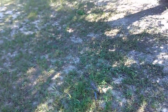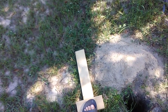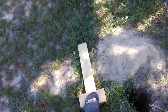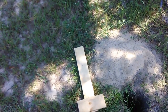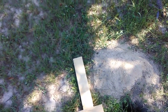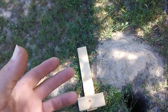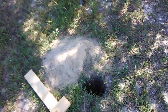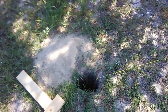When you get your lumber to do something like this, always pull out the heaviest, beefiest lumber you can. You've probably noticed when you go into a lumber store and get some treated wood, some of those boards can be light as a feather and others can be heavy as hell. The heavier the board, the denser the wood is and the longer it's going to last. Always get the heaviest boards you can for something like this. I expect something like this will probably last 10 to 15 years — and as old as I am, it will probably last longer than I will.